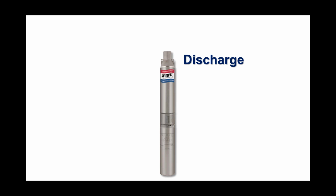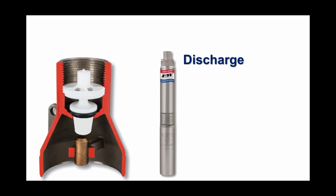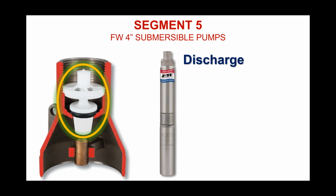I get that. But at the same time, that field scrapping policy, which is industry-wide for the most part, has a disadvantage: over time we can become disconnected with how pumps are constructed, especially if any changes have been made. So we're going to start off up here with the discharge, and a little generic conversation at this point, but most every pump manufacturer will have a couple of components up in this discharge. One is what we call a check valve, or a Poppet check valve assembly.